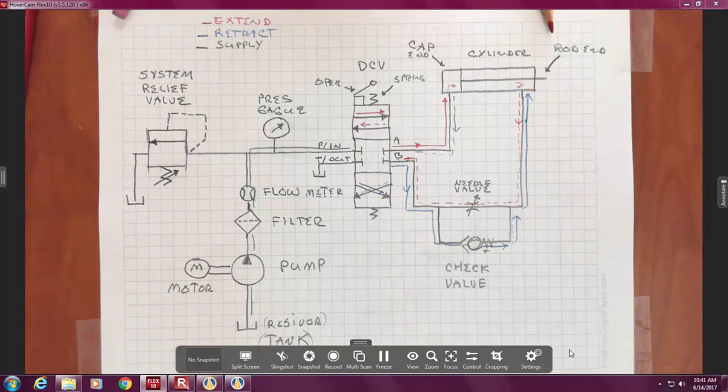Yep. And now we want to also get rid of this idea of pressure. This thing produces flow. It does not produce pressure. And everybody calls the pump makes the pressure. The obstacle makes pressure. Okay. So if there is no flow, and here's a pneumatic version, roughly that's standing still. So far I'm lifting the air over here up and I'm lifting the mass of this. So there's a certain amount of ability of the pump. The pump has a rating on it called pressure. What it means is when the fluid can go backwards through it.